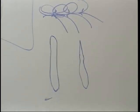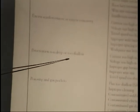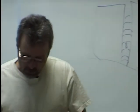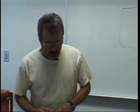If appearance is important, corrective action may be required — just hit it with your grinder. The book references table 23.4 for troubleshooting, but that's a typo; it's actually table 23.6. It's a troubleshooting guide listing issues such as voids and cracks, penetration too deep or too shallow, porosity and gas pockets, undercutting, and longitudinal depression in the weld face, with possible causes and corrective actions. Turn to page 870 to find it.